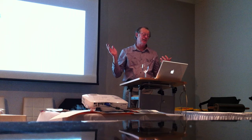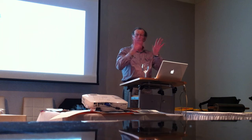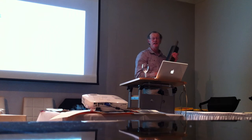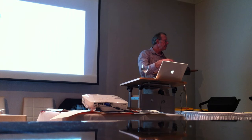Burning in, another trade term. Well, once you expose an image on a plate, you have to change it to enamel. So you went into an oven, or did it over the gas yourself, where you put it in a burning in oven until it turned black, and then came dragon's blood. Basically, it was a resin. That was used when you did the old rock and roll hand etching. Dragon's blood is what you dusted the ink with when you inked up. Then you'd heat it up over a flame and it would become a protective coating for the next stage of acid etching.